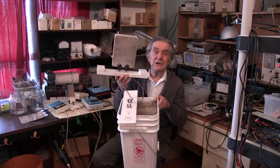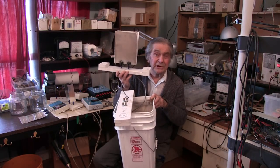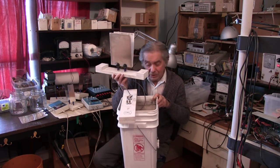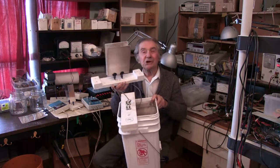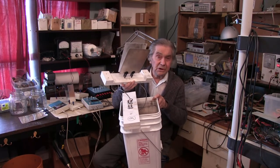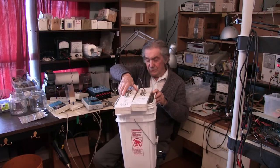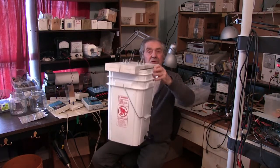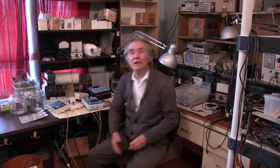You'll notice the electrodes and everything seem a bit black. This is because whenever you're working with metal ions and atoms, a lot of them plate off — it's like electroplating, unavoidable on the inside of the container and on the electrode. Before each session it's good to clean off any deposit or oxide that forms on the electrodes. This is an example of a small commercial unit, and we can scale up to 55-gallon drums or more.